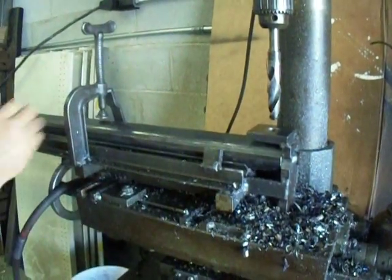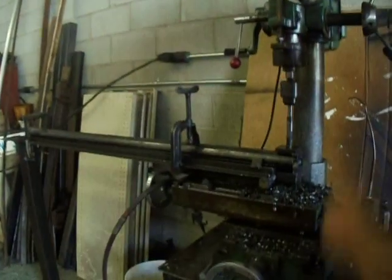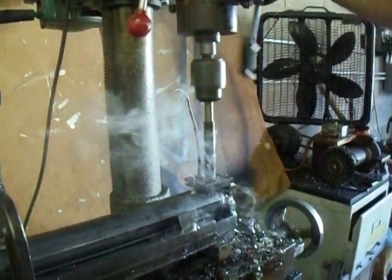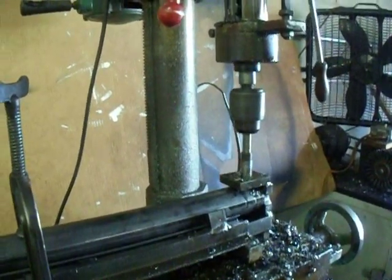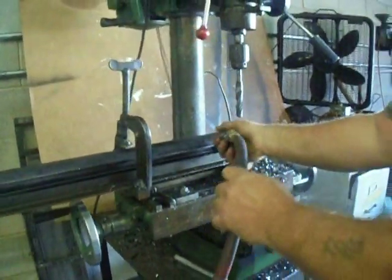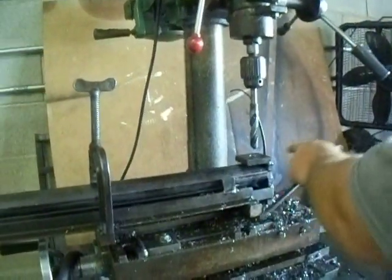The pipe goes in, seam on this side. All the way in — that seam lines up with this little block. That block is just a guide line. 11 sixteenths hole with no pilot. I'll keep a little bit of oil on it. As I tap it out, I'm knocking the burr off the inside of the top hole.